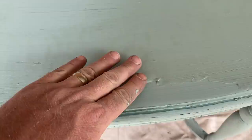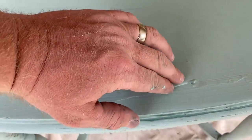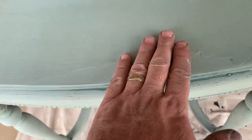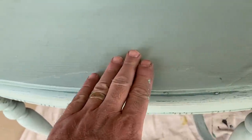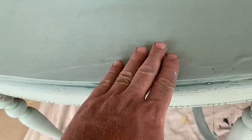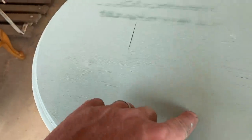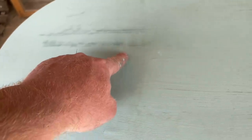Right here on the edge of where the bondo was, the veneer was not glued down — it was getting ready to bubble again. So I'm going to sand this again even though it's painted, sand that smooth, and then paint over it again. This is what we were talking about with bleed-through — you can kind of see the coloration here where it's got some varying tones of color we don't necessarily want. That's why this is probably going to get a white wax.